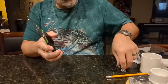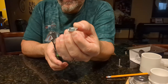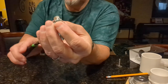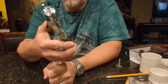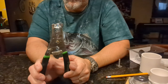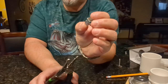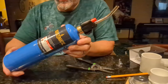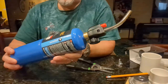You'll need a pair of pliers or something to hold the prong T-nut, because what we're going to do is heat it up and tap it into the hole we drill so the prong T-nut goes into the PVC. We'll heat it up with a torch — a heat gun would work too. You want to heat it up so the prongs get nice and hot and sink into the PVC. If you try and tap this in without heating it up, it won't work — it'll just bend the prongs and won't secure it. I'm going to use a propane torch. Anything to soften the PVC will work.